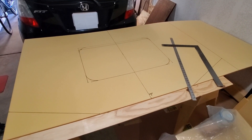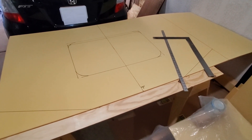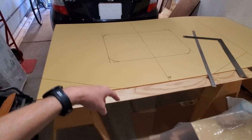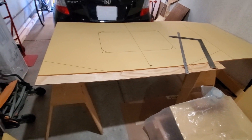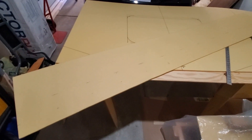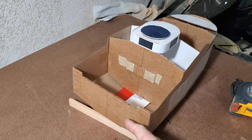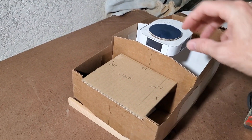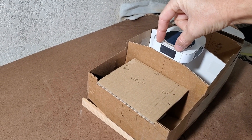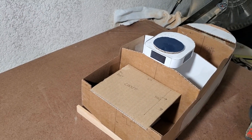This is frame C5. That opening is what I'll use to crawl into the stern where there'll be cargo space. And here's the transom upside down. This piece of foam is 16 centimeters too short, so I'll have to do another butt joint with this scrap piece. Here's the largest frame — C5 — and there's the transom. The doghouse is 80 centimeters wide, so I'm going to add this portion of the back of the doghouse and have it integrated with C5 — that should be stronger that way.